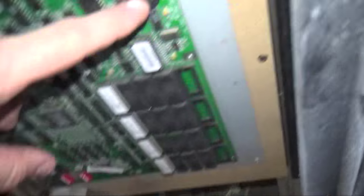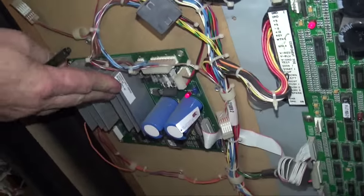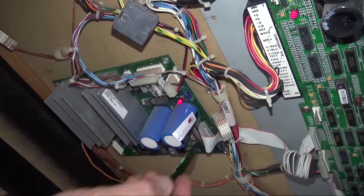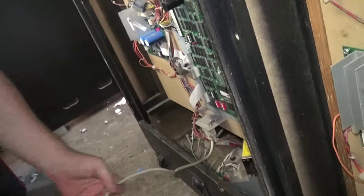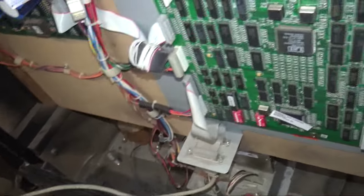Televisions have been rebuilt. We've also put new power supplies on everything — the computer grade on the bottom — and we've changed the batteries, just like we always do in these games. The steering amplifier and steering board — you have to reflow solder on these connectors. They have to be redone, even the ribbon cable. These are connected by way of the television cable.